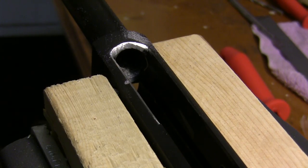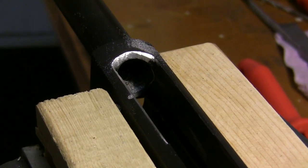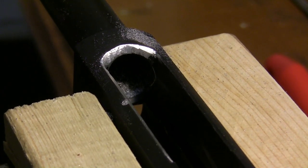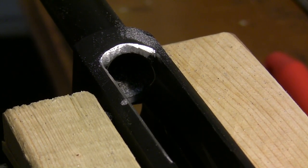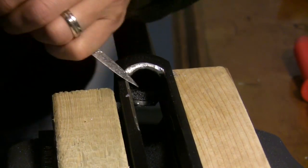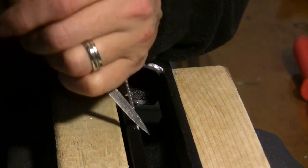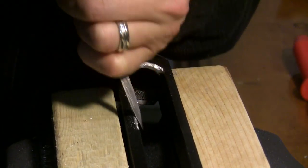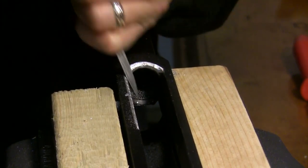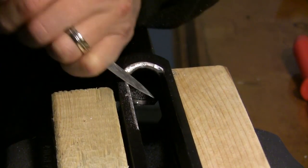Here you can see I'm about two-thirds of the way done. I've got the right-hand side — the strong side of the receiver, which is actually on the left side of the screen — pretty much done. I've also got the forward end of it done, the actual loading port. That is the most important part of this job — right by where the follower is going to be, where you're going to be forcing your shells into the magazine extension. Here you see me going back with the triangular file and just beveling out the edge.